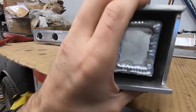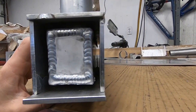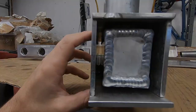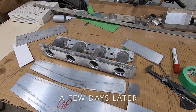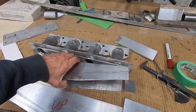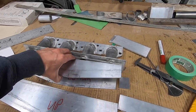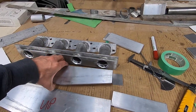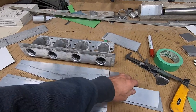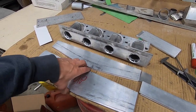I still need to cap off the ends. I actually left these open till last so we can see right through and see where the water is going to flow through the water jackets. The next step is tacking the front and rear panels of the exhaust log on, then capping the ends off and putting pieces on the top and bottom, and then welding the jacket in place.